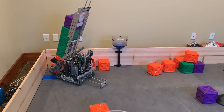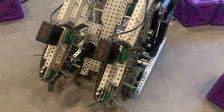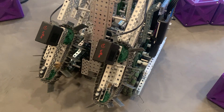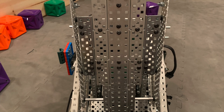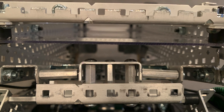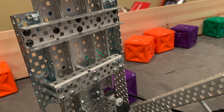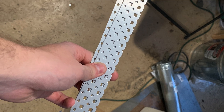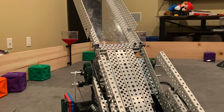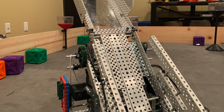The next major part of the puzzle was the tray itself. We wanted to go with a thin tray that fit between the roller fins to prevent conflicts with the rollers. This tray increases in width after a point, providing a good amount of surface for the cubes to ride on. The button screws on the tray are absolutely necessary — when we first built this bot we had issues with the tray bending, so the screws keep the cross beams attached in multiple places to combat this. The sides are cut down aluminum plates, which give a small amount of support to the cubes when stacking, but are mostly there to attach the second stage of the tray. As the sides are pretty short, the cubes are really held in by these walls mounted to the roller arms.